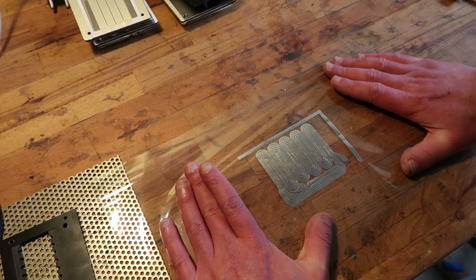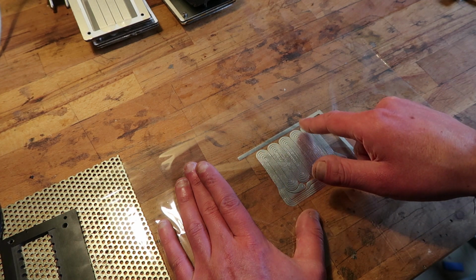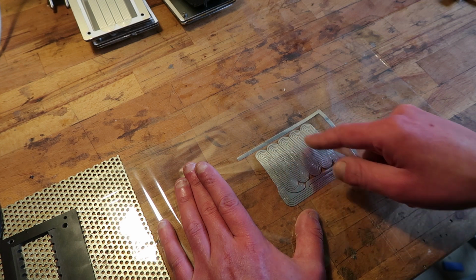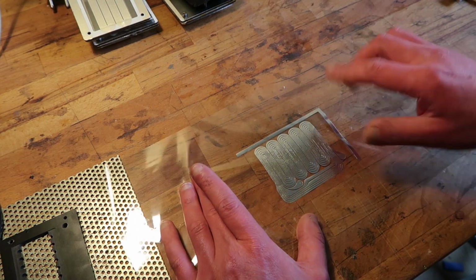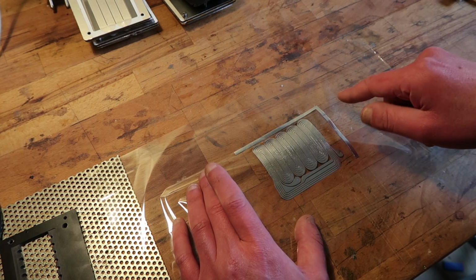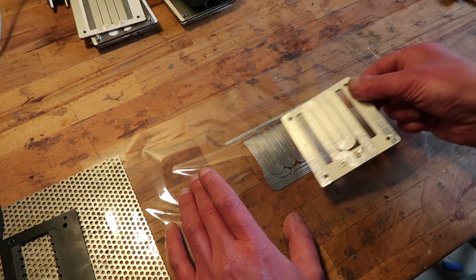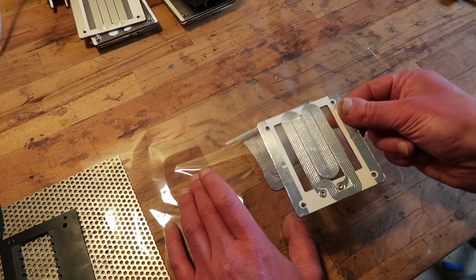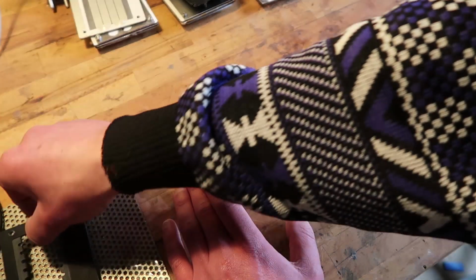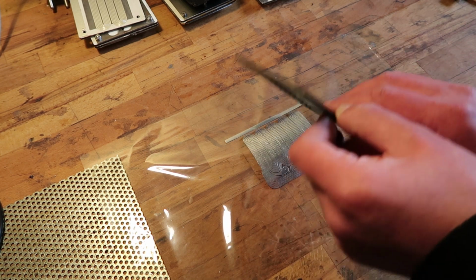So this is the coil. It's a rather interesting coil, I think, this time. So it's bigger here, the tracks, to save on impedance. So low resistance here and here and here, and less low in the middle, just to make sure that most of the impedance is used in the magnetic field instead of making turns, because the way I make this tweeter has a lot of turns. I know it's not the most efficient method. I mean, here we only have 3 turns. There we have much more, so we waste some of the power. And that's the way it is. In my case, it has also another benefit, but it's that the connectors are on the side. So if you got 2 of these, you can place them rather close together if you would like to make a line thingy.